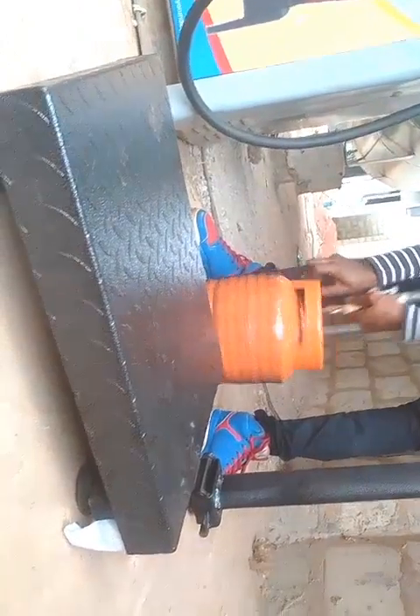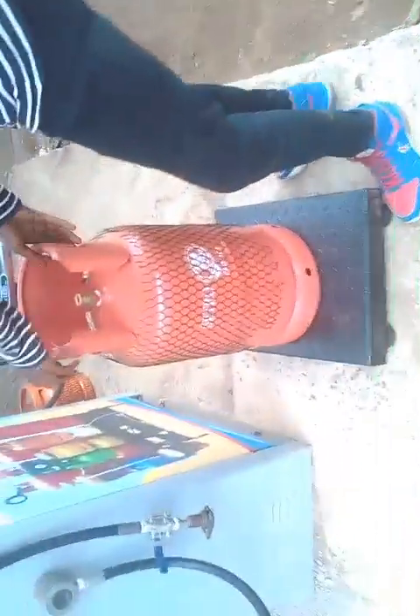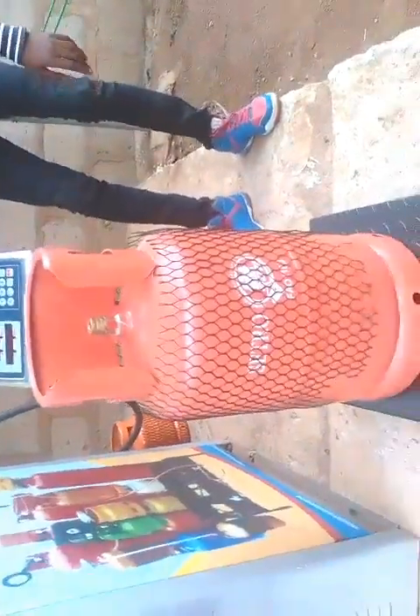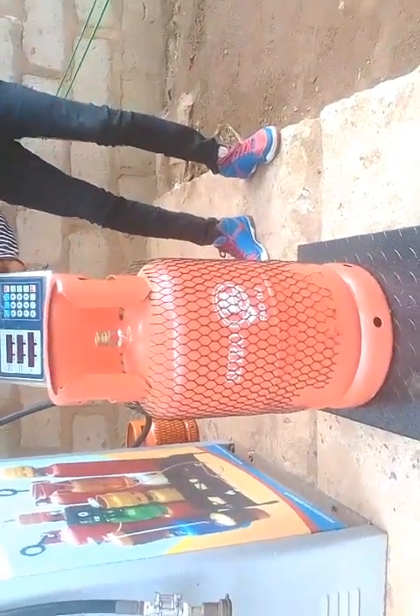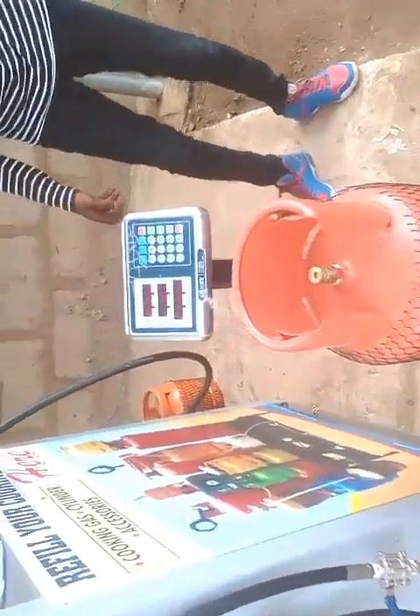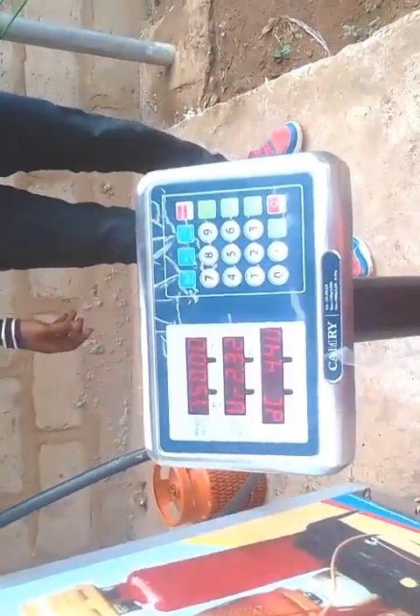Following the above instructions will give you a total weight including the filling gun nozzle and the total tare weight of the gas cylinder when placed on the digital scale. Checking the digital scale display screen will give you a total figure including the 6 kg figure of the gas cylinder plus the weight of the filling gun. When filling at the gas plant, make sure you use a digital scale with two screens — this will help you and the customer both see the reading, to prevent any complaint of cheating or mistakes.